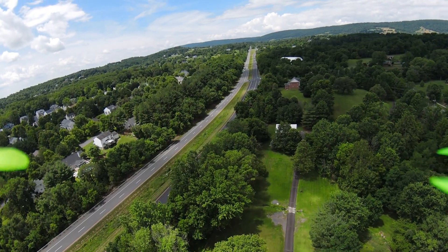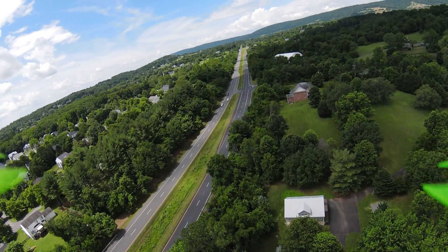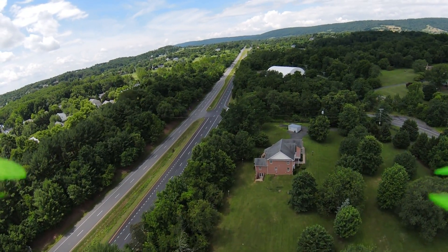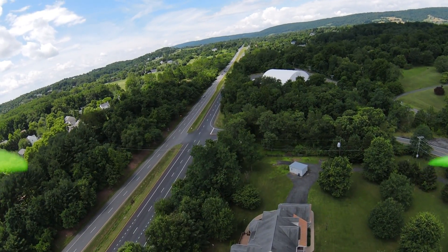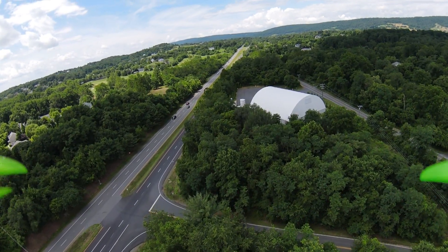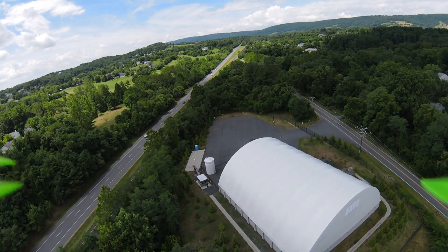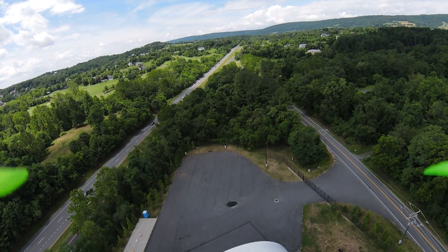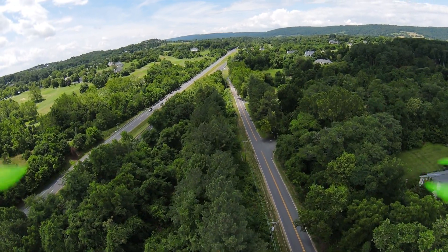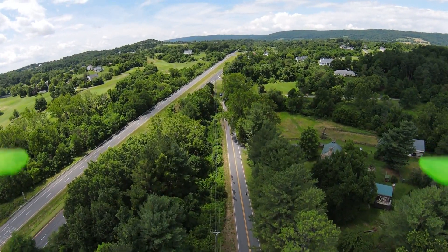So where were we — talking about the power of the goggles. I'm stuck at 25 milliwatts and I cannot get off that. I've followed video after video, web page after web page. I created a file called NACO.txt, saved with the number one in the body of the text file, put it on an SD card into the aircraft, started the aircraft, and I'm still at 25 milliwatts. That's 1/28th of the power of 700 milliwatts. Think about it — if I can fly a mile at 25 milliwatts with patch antennas, if I get this thing up to 700 milliwatts I could maybe go five or six miles out.